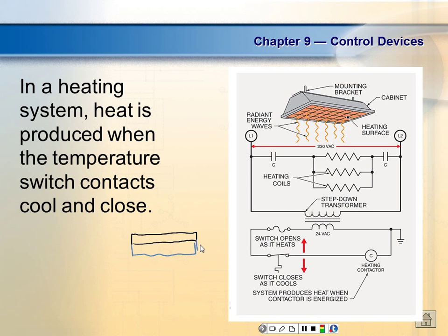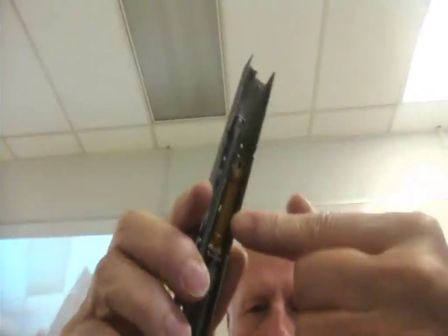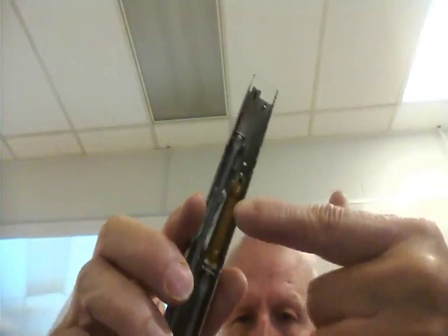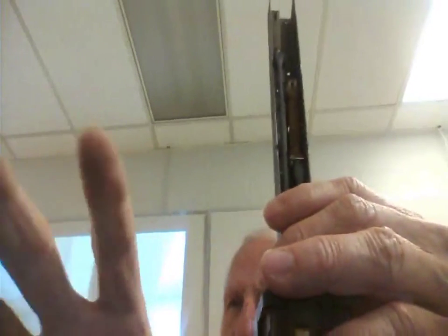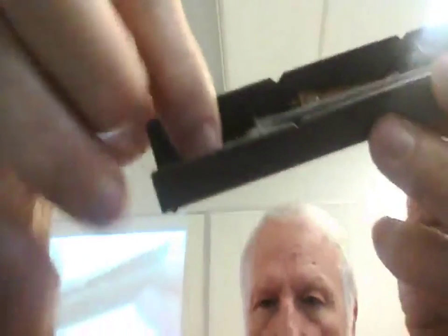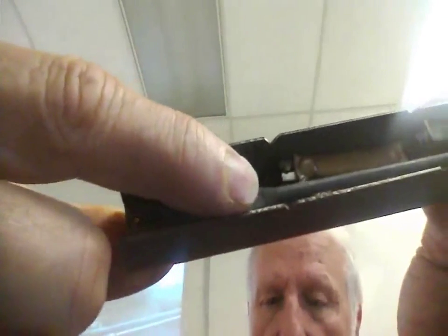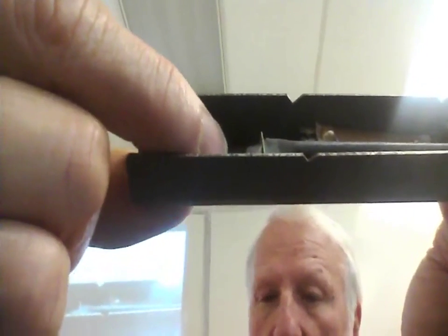This device has two types of temperature sensors. It has an analog sensor called an RTD — Resistive Temperature Device. This is coil wire: when we heat wire the resistance goes up, and when we cool it down the resistance goes down. That's the analog RTD sensor. There's also a bimetallic sensor right here — the bimetallic strip. When you heat it, it bends and causes a wiper to move, and you can hear the little limit switch click at the back.